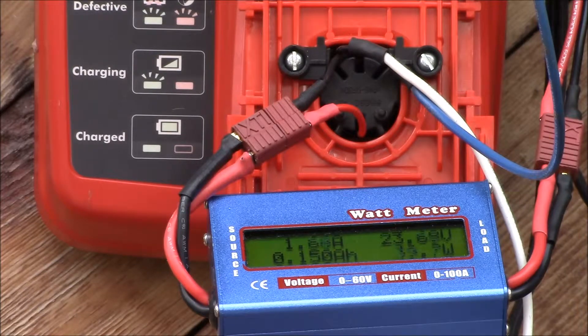I'll let this one run and see what kind of amp-hour and watt-hour rating we get off this pack. This is a pretty old pack — one of my original C3 batteries. Being a NiCAD, it self-discharges in a month or so, and this one's been sitting around about a month, so it was pretty flat, down at about 14 to 15 volts.